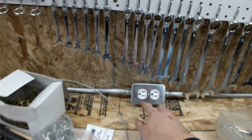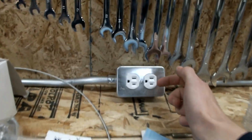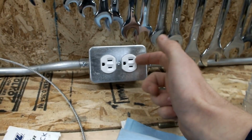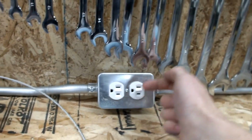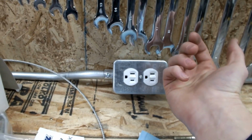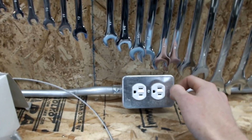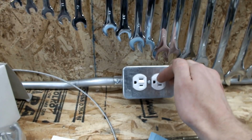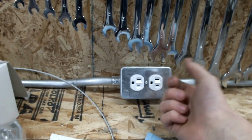My reasoning for these is this top one is the neutral pin, and it's actually a reference to ground here for this code. So then what that means is if it's out slightly and something hits it, it's not going to shock. It's not going to be live at mains voltage. Whereas if this is turned around, then the live pin is at the top, and if something touches that one, if the pin is slightly out, then it's going to be live at mains voltage.